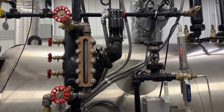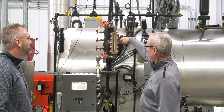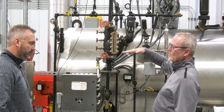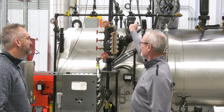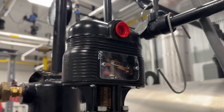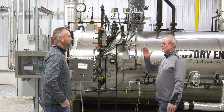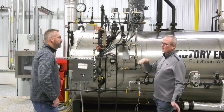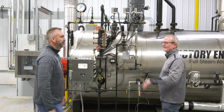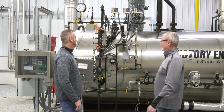This particular control has a float mechanism inside, so it floats up and down as the water level goes up and down. There's a slide control in here that is sending the signal out telling the feed water valve where the water's at — open the feed water valve up, close the feed water valve. It works kind of like a toilet bowl — exactly like it.